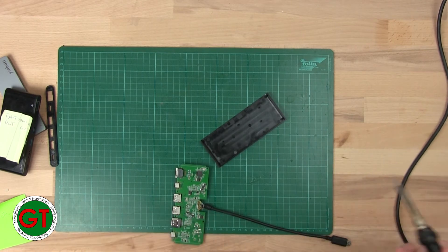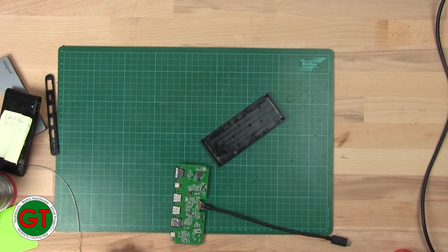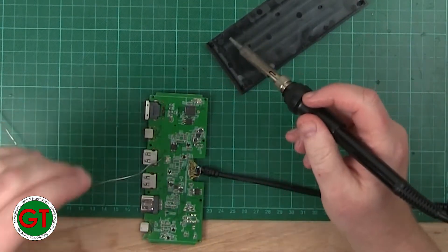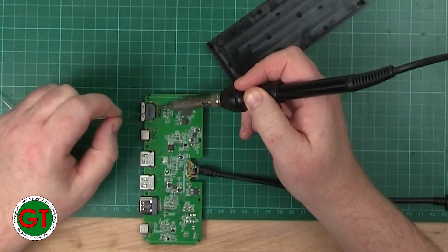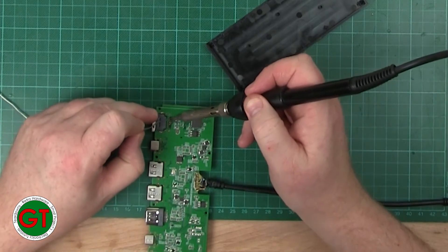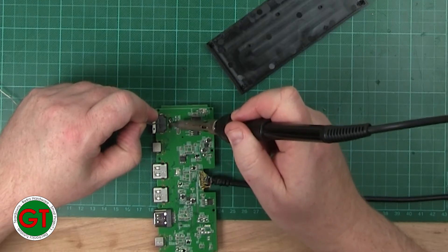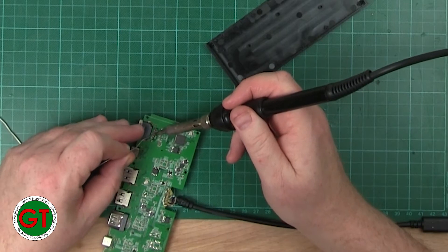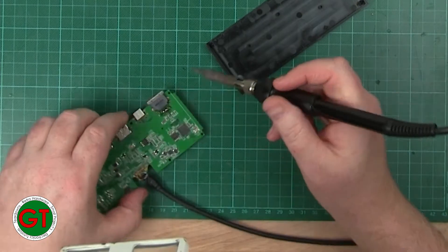So let's do that. I'll work on the underside — a little bit of flux on there. You just want a small amount, just to help the reflow. This is probably lead-free solder already on the board, so I'm going to add some leaded solder. I'll put the solder on there and we'll clean it up afterwards.